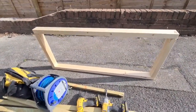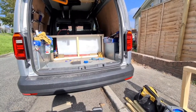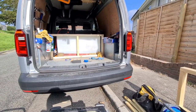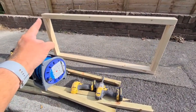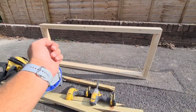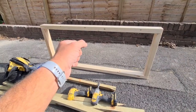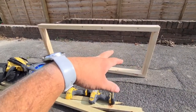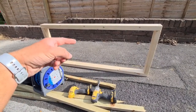I've built a second frame which will go here and that will be effectively the front of the bed. I've got batten here which I'm gonna put on the inner edges down there and across there, because this is gonna have a pallet wood front to it. I don't know which way I'm gonna run the pallets actually, whether it'll be horizontally or vertically. It's gonna have a pallet front to it which I'll be able to remove, and there'll be storage under there for like our camp stove, chiller box, spare clothes, all that malarkey.